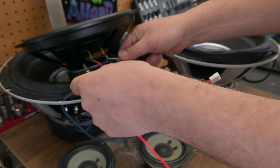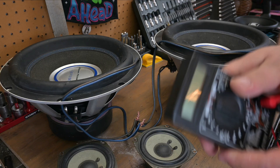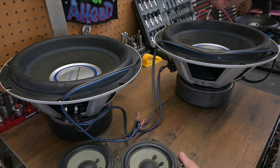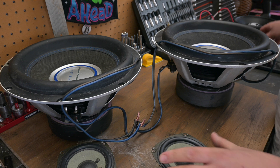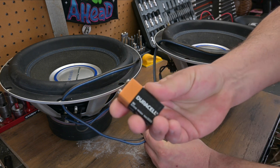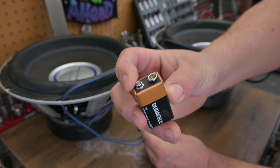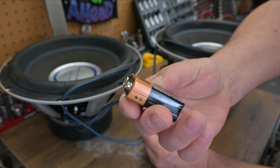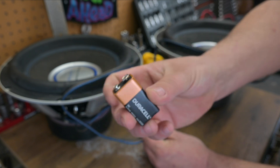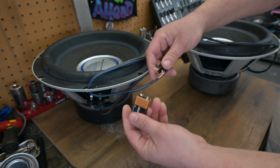Before I explain why that is, let me go into a bit more detail. It's not my voltmeter — my voltmeter is just fine. I'm going to show you how to tell polarity on unmarked terminals. Grab a battery. I don't normally recommend a 9-volt, but the smaller terminal is positive and the bigger one is negative. Batteries are always marked. I usually suggest using a double-A for this.